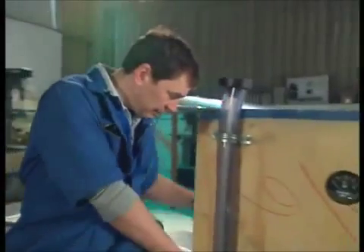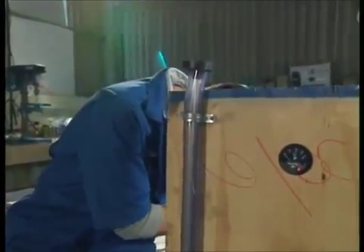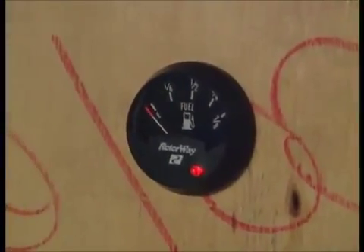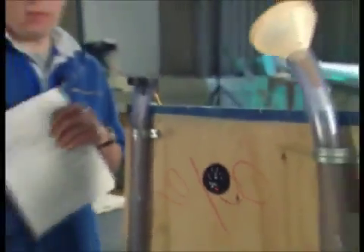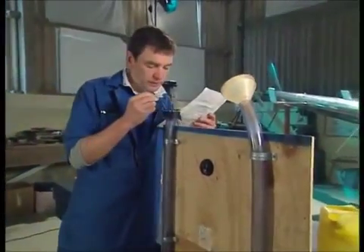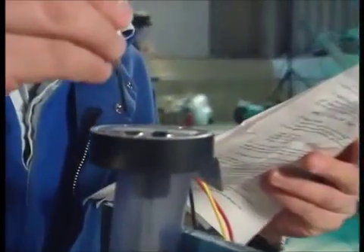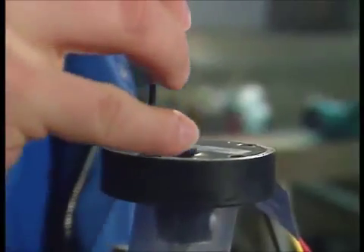The first instruction was to mount the gauge in a convenient place — so there it is. Then you connect up the battery to it. In this manometer tube — I remember that from physics — it's empty, there's no fuel in it at the moment. On the top are two screws: one says full, one says empty. I have to turn them both fully clockwise.